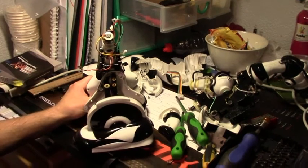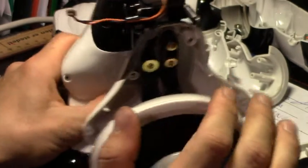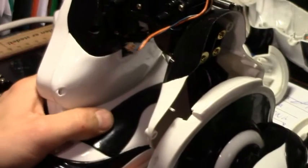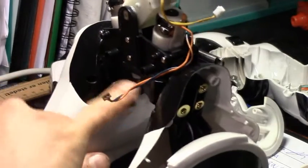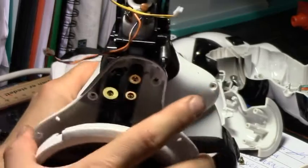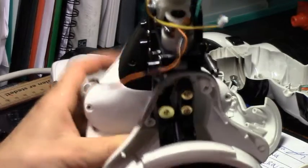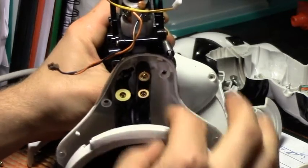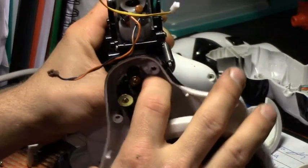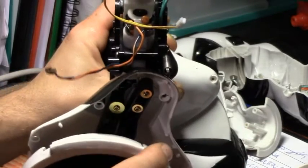So it's another mechanical design here. As you can see, we have one that is fixed and one that has an output to the motor gearbox. The motor is here, and there's a gearbox, and the shaft goes out and connects to, I believe, this one, but I'm not completely sure. I believe this is fixed. As you can see, when I hold this still and move this foot, it kind of pivots on this and kind of pushes this, and that is what creates the moving action.